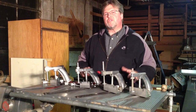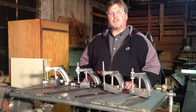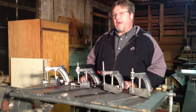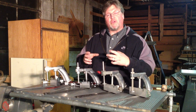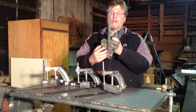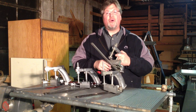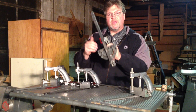Another thing that happened in the 1980s is they came out with the larger version of the Mark V called the 510. Prior to this, the shaper fence that you would add for shaping would clamp onto the two ends of the table saw. The problem was, as the table got bigger, it didn't make sense to make an unwieldy large shaper fence. So instead, they made the base smaller and drilled holes into the tabletop to bolt the fence in place. Well, lo and behold, when you tilted the protractor to certain angles, those nylon glides would drop into those holes. So ShopSmith came up with an interesting solution — they changed the casting on the protractor, and instead of using small bullet-shaped nylon glides, they went to large hex bolts, where the face of the bolt now runs across the table, eliminating the problem of those dropping in.